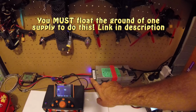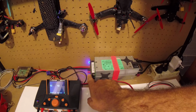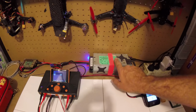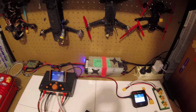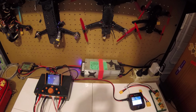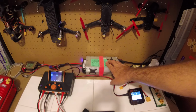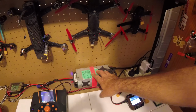And I've got this little guy here, from I think it's coolice.com, it's a protection circuit. What that does is, if one of these dies suddenly, it'll cut the power to the output. Because if one of them dies suddenly and the voltage suddenly halves and you're in the middle of charging, it can pop the iChargers. They don't like that sudden surge in current. So this gives me 24 volts at up to 100 amps, which is frankly insane and overkill for what we'll all need, but we like headroom.